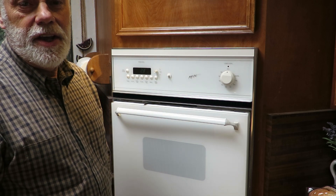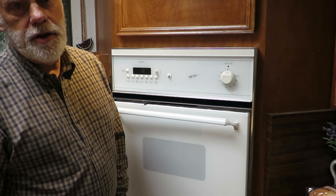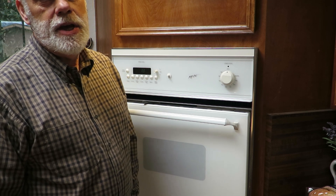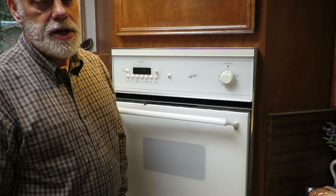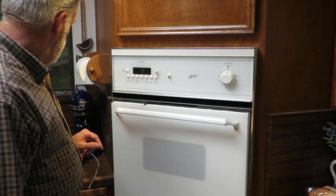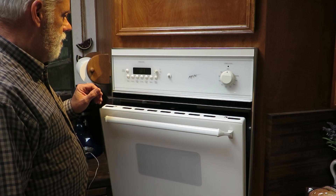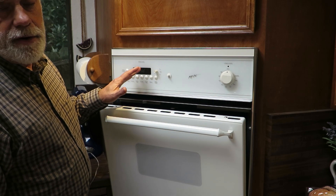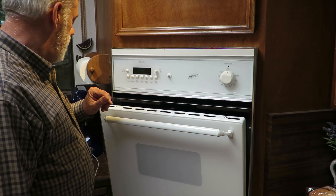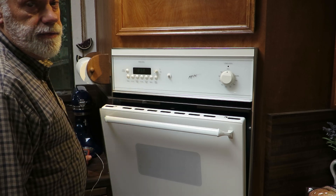I'm at home in my kitchen, and we've done tests showing that hot melt adhered EPDM rubber liners put in with a hot glue or hot melt process can delaminate and release at 158 degrees. I put this in the oven with the samples, and after I have this timer set for three minutes, the temperature is at 165 — we know that at 158 it releases.